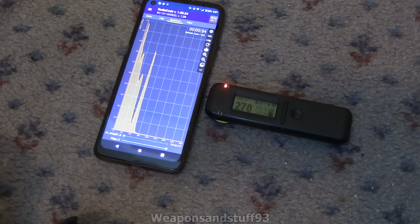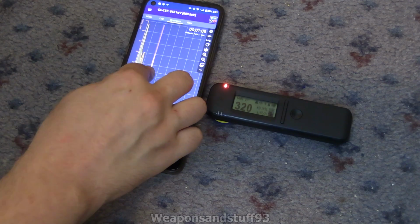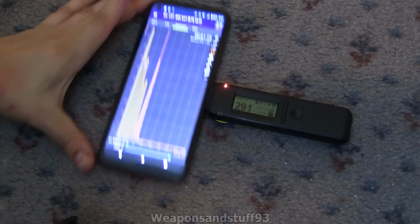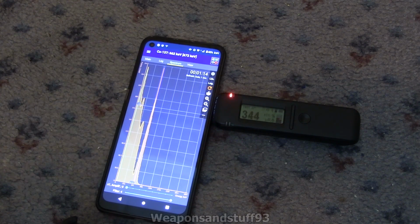As opposed to it being something like, oh, I've got this alloy and I don't know what's in it with radioactive materials, or I'm using a Geiger counter on Fiestaware and it's going crazy sort of thing. So anyway, let's see, what spike is that one there? Cesium-137, look, there we go. There's that big spike there, and it's correctly identified as Cesium-137.